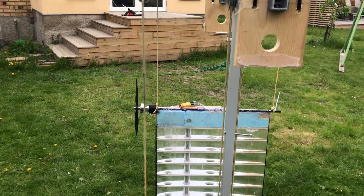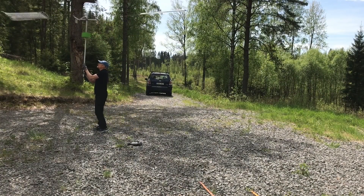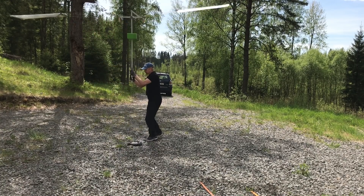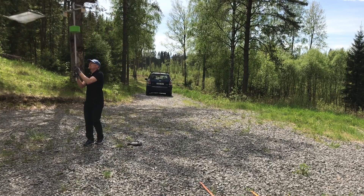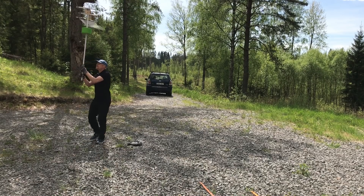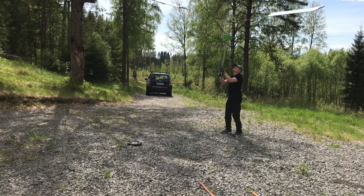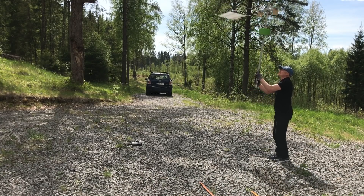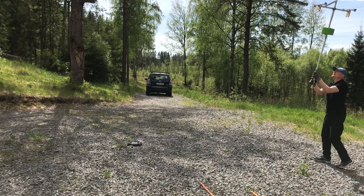This was a little step forward to have them spinning in a controlled fashion. Here I'm trying to get a feel for how much gyroscopic precession or phase lag there is. I'm tilting the mast left and right and back and forward to see if the response is at 90 degrees or some sort of offset. It was actually very difficult to draw any good conclusions from this, and the wings are not perfectly balanced, so it is a little shaky.